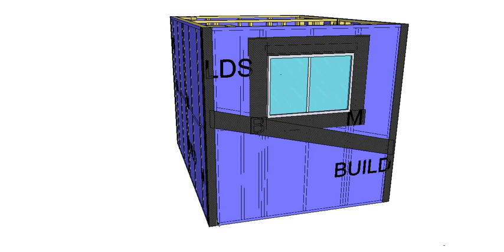So you flash down your corners, flash around your window, all the way around. So everywhere you're going to cut and join your weatherboard, you should have flashing underneath it. And this flashing needs to be layered so that if water was to get onto this flashing, it would then run onto this one down the side of the window, and then that would run onto this one, and then run out of the next weatherboard that's below it. So you don't want to have them lapped so that if it got onto here, it ran in behind this one. So you have to layer them so this one's on top, and this one runs down and runs over the top of this one, and that one would be set up so it runs out of your weatherboards.